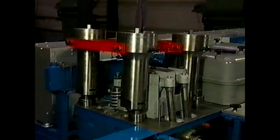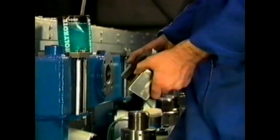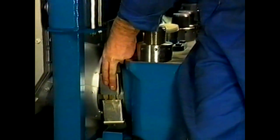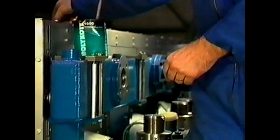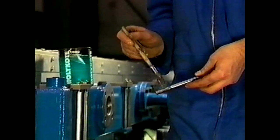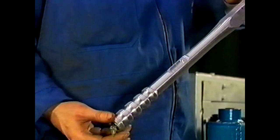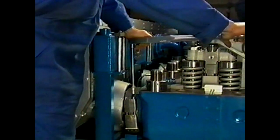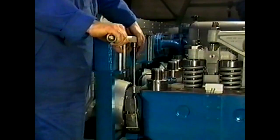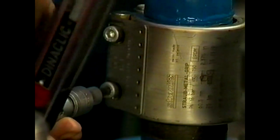You can start, for example, with mounting at the exhaust side. For this purpose, grease the inside of the upper exhaust clamping ring with a heat-resistant lubricant. Subsequently, place the clamping ring over the exhaust flange and mount it with the four socket head screws. Treat the screw thread of these bolts also with a heat-resistant lubricant as specified in the instruction manual. These socket head screws are tightened to a specific torque — this torque wrench is a standard delivered tool with the engine. Use a new gasket when the cooling water discharge pipe is mounted. The bolts of the rubber clamping piece are also tightened to a specific torque.